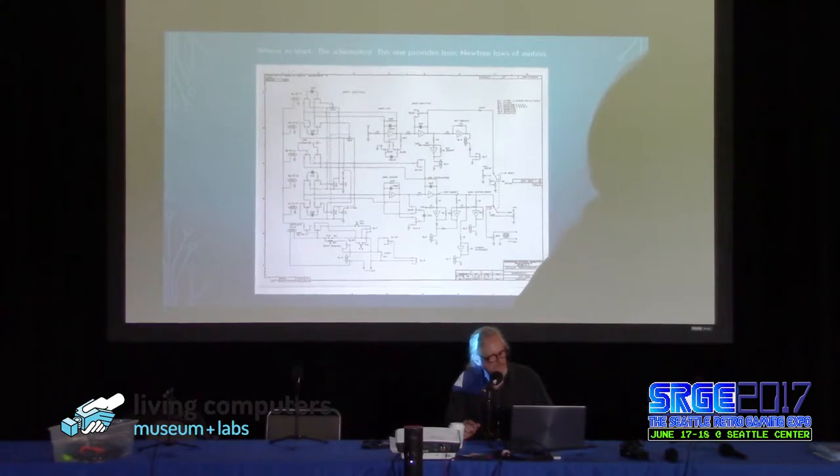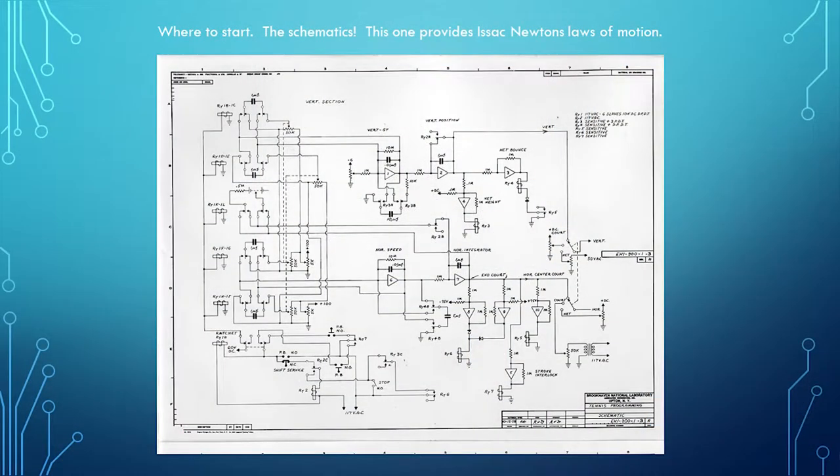And this is where, to me, things get interesting. Because these little triangles here are all internal to that Systron Donner analog computer. And in a way, back in the day, they had it a lot easier, because they could use plugs, you know, change the connections and find the right ones a lot easier than I can. Because nowadays, with things being so small, how do you make sure that your design is correct before you spend a whole bunch of money building it and getting mistakes? It's something an engineer spends a bit of time worrying about. And I had to basically get this whole thing, and have a lot of confidence that it was going to work before I ordered the circuit board and had all the surface mount components mounted onto it.